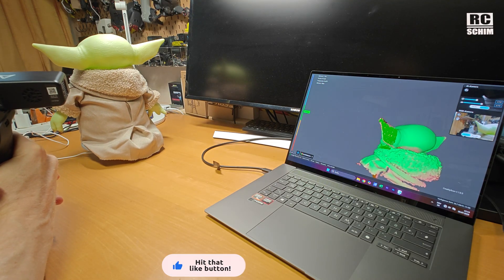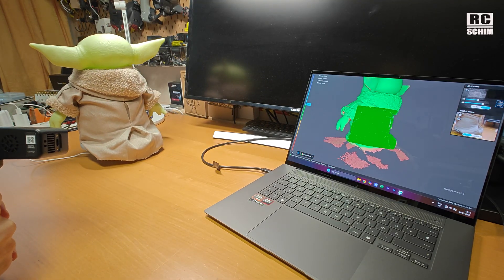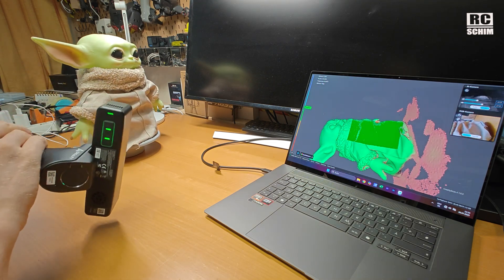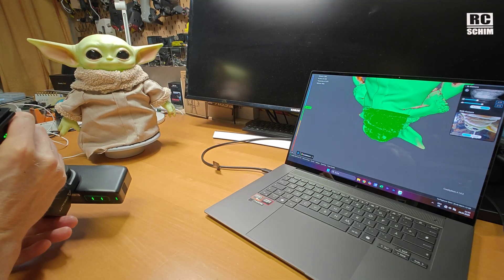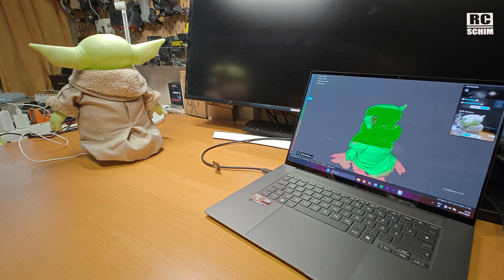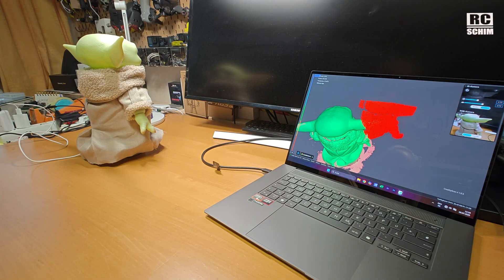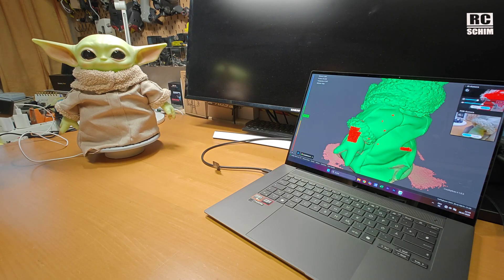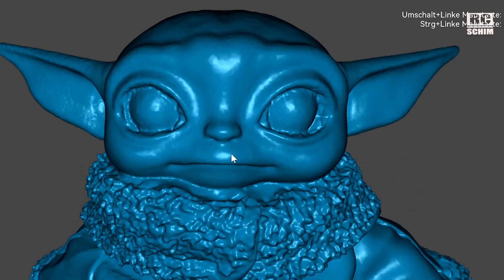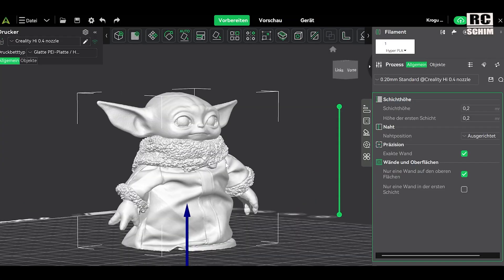The tracking is really nice so we don't actually need to make two separate scans and align them - you can just pause and change the angle, moving in and out to get more holes closed and get the inner angles of the hands. I turn it upside down slowly to get the low shot. It's closing in on all those different angles including the top of the head. We lost tracking - okay. Our goal is to close all the unknown parts. Imported into Creality, the print from Creality Scan complained that one million triangles is a bit much.